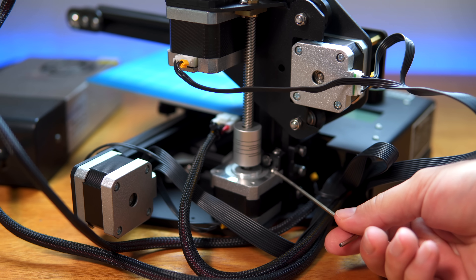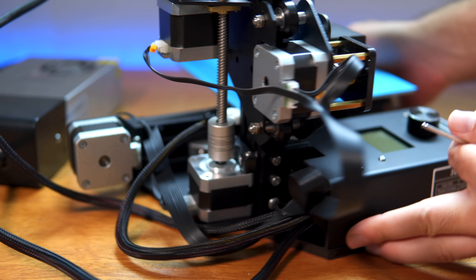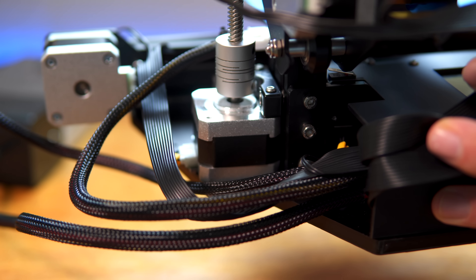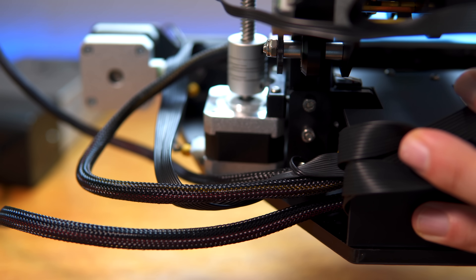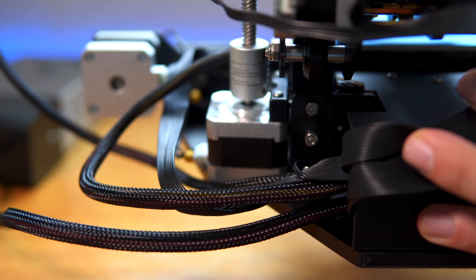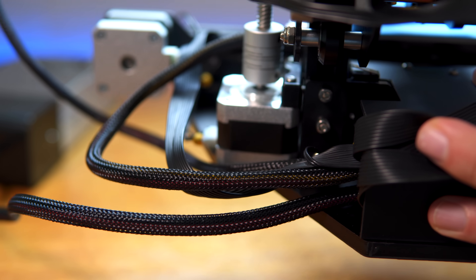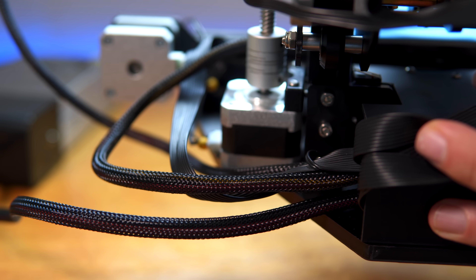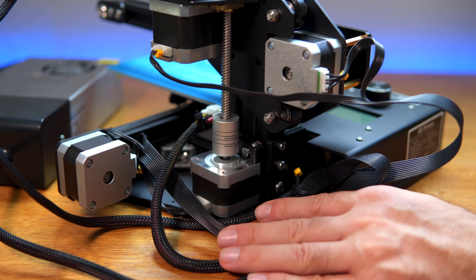Before I would have had a hard time spinning it — when I was putting this thing together I was wondering why it was so tough. There's also a gap between the motor and the channel on this side. You can see that gap right there — that's where the rod wants to be. So we need to shim that out too; the motor wants to go out and that way.